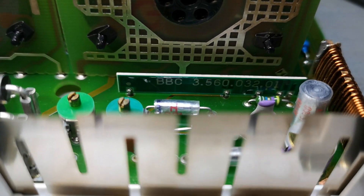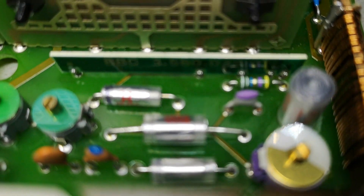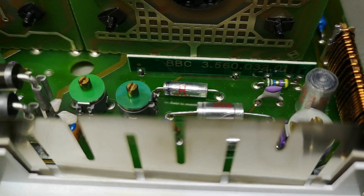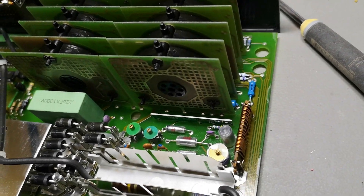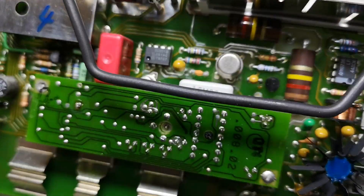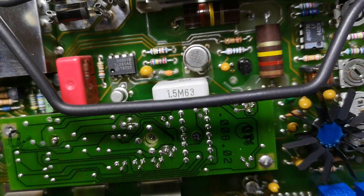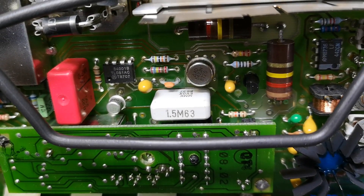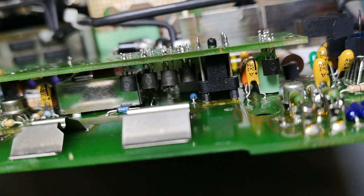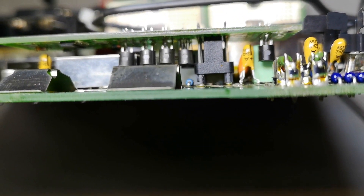This one is definitely the voltage divider resistor — it is really really nicely made, with some really really thin lines and all sorts of stuff. I guess this is the voltage ranges. I see an AD542 — that is an op amp. And this little plug-in module — I really can't detach it because it's soldered on both sides; it is not a socket. Bad luck. And there's an IC up here, so this could be the RMS converter.